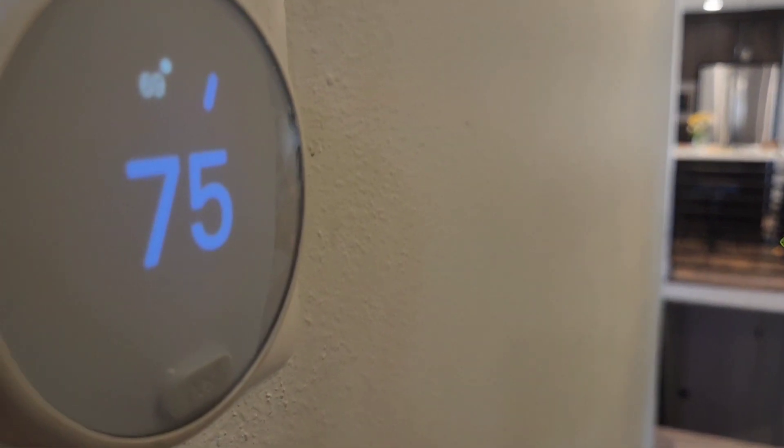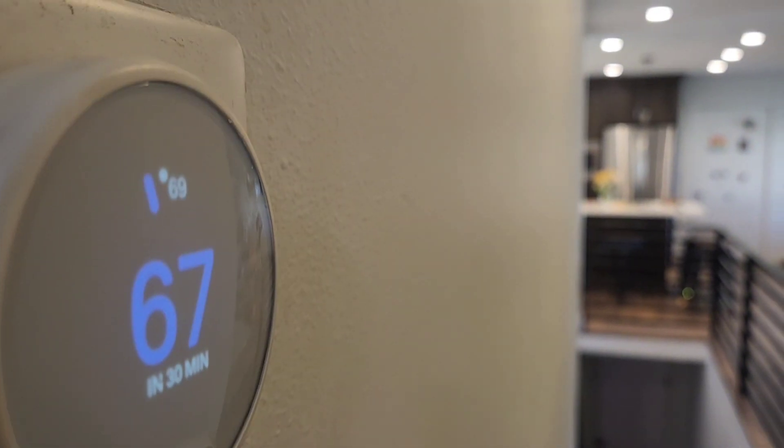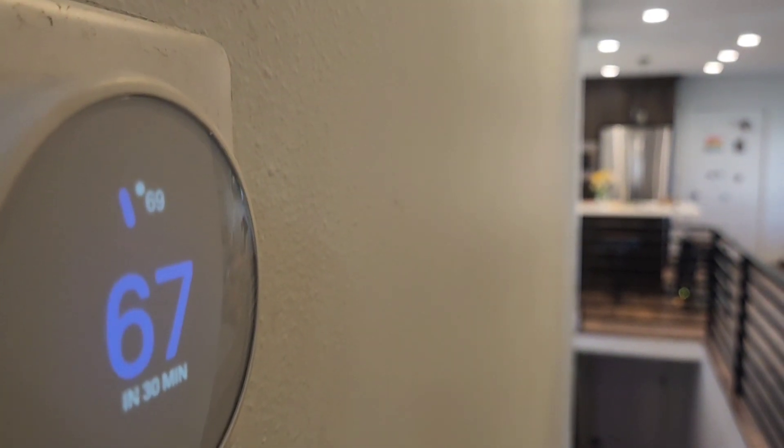I don't think it's going to work — I think I'm still going to get the dimming, but let's try it. Just a slight dim — that's not a whole lot of dimming there, but I think it's about the same as it was before. The peak surge capacity of the 26,000 XPS is 2,400 watts, and when my air conditioner starts along with running my house that's almost 2,200 watts — really close to the peak. You know, when people just generally turn their air conditioner on even when connected to the grid, sometimes your lights dim anyway depending on where you live.